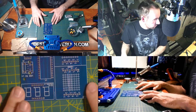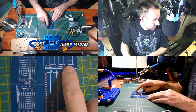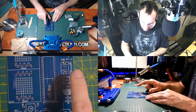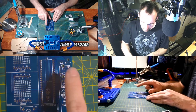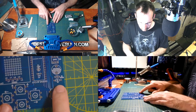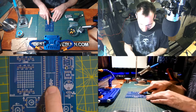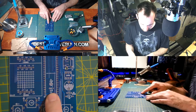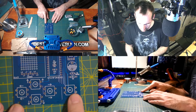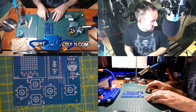This is a fairly simple board. We have what I guess would be the counter, dot matrix screens right here — just two of them. Here's where the IC would go. I think that's the power button right here. We have our full-sized USB 5V in, a speaker, 1K resistor, transistor, an electrolytic capacitor, and a ceramic capacitor. We have our left, right, up, down buttons, and I think that might be the reset button. And that's technically all that's on this board.